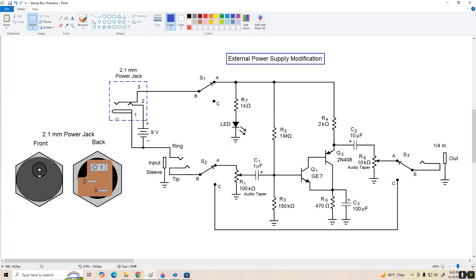The next thing I want to talk about is the distortion of this circuit. As it sits right now, it's a pretty decent, smooth sounding distortion — it's not very heavy. I'd say it's good for maybe blues type applications, but if you're into some heavy distortion for metal or grunge, this is not really going to be sufficient. What we need to do in those applications is add some more gain to the circuit.